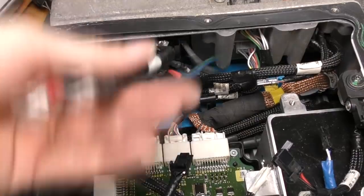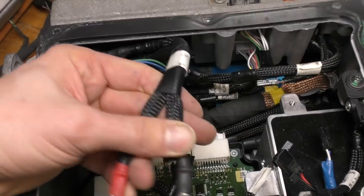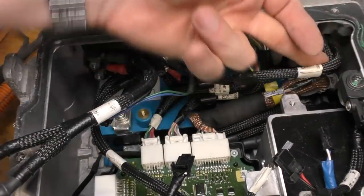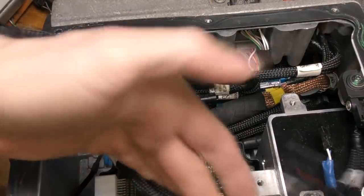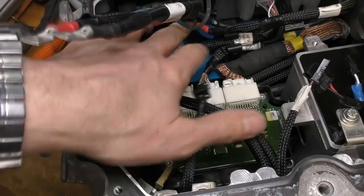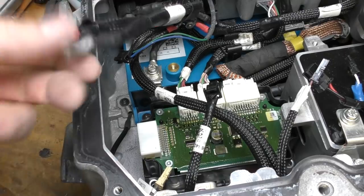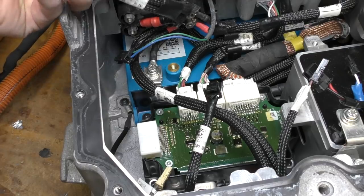The wiring is fairly straightforward — we've got the high voltage input going to the battery input bus bar into the fuse holder, with two cables coming out: one going to the air conditioning compressor and the other to the heater connection. There's a separate fuse for positive and negative but they're both connected together. Something like a stalled air conditioning compressor might pull 40 amps and blow the fuse.